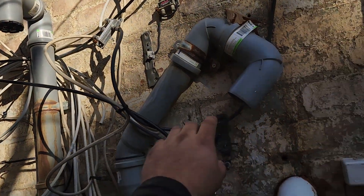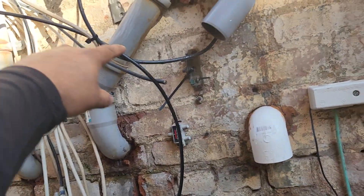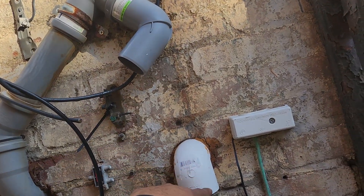As for the sagging of the screen mesh inside, Navien usually has me send pictures of everything to make sure everything else is correct. Also, this fresh air intake was no longer being used. I think there was cross-contamination with the fresh air and the exhaust being too close.